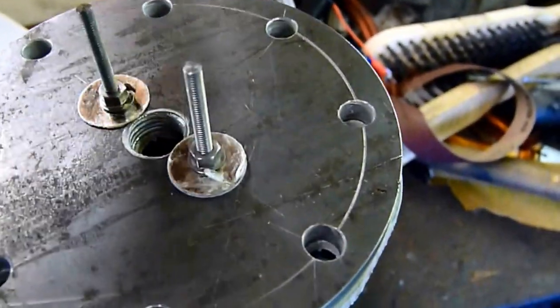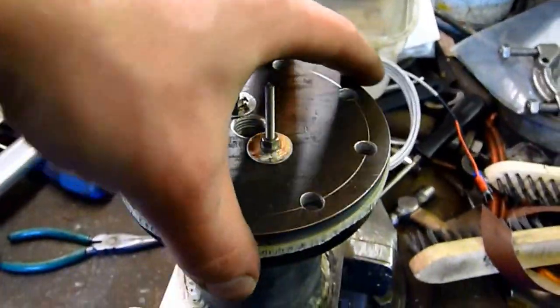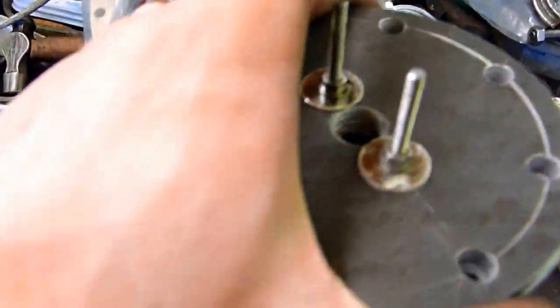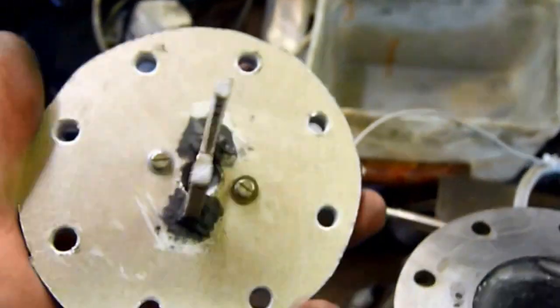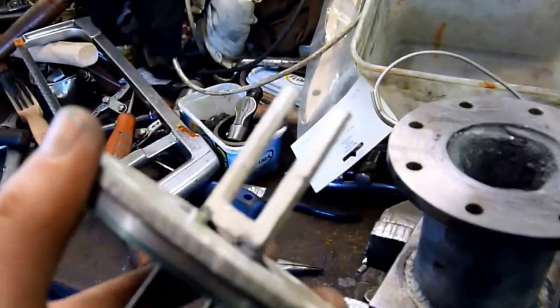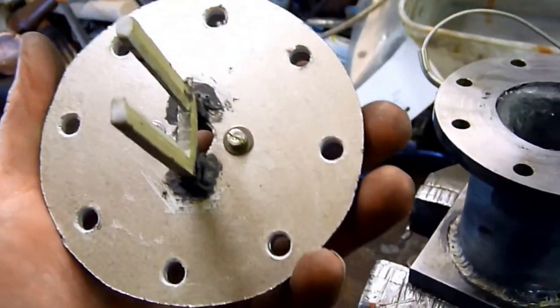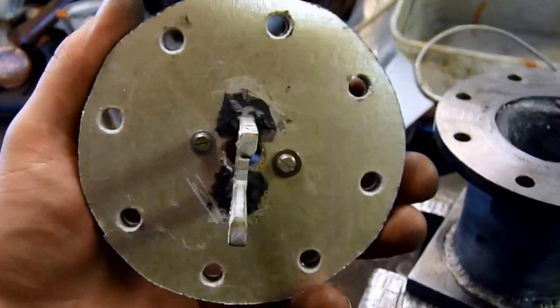The air will come in here. I'm going to have a piece on here and it's got to have several connections because I also need air to go off to the pot with the powder in to partly pressurise it. I'll probably have to have two air connections coming in to actually get enough in with standard fittings. And then we've got the piece at the bottom which connects to the nozzle. Next time, once I've worked out how much tungsten wire I want on it, I need my control unit to come in here for the power.